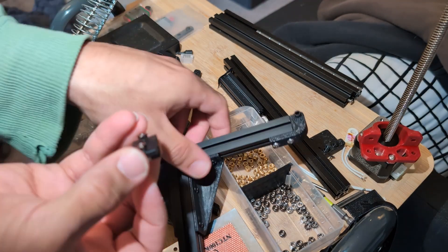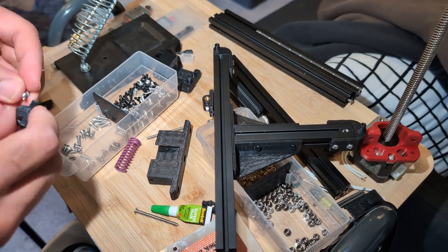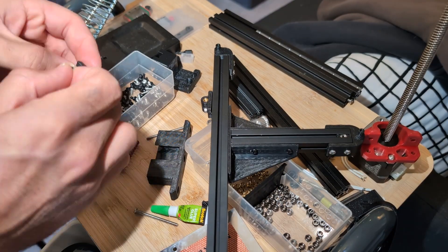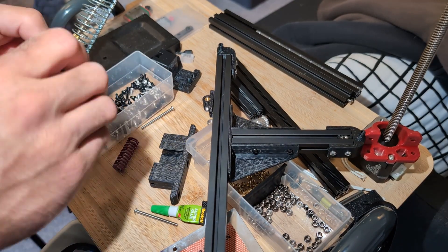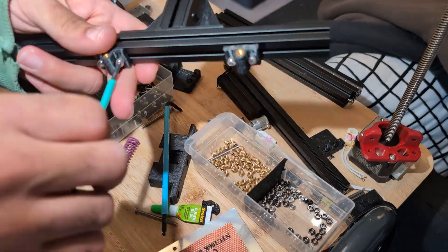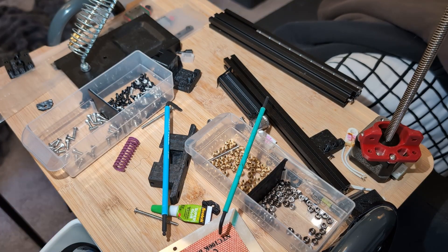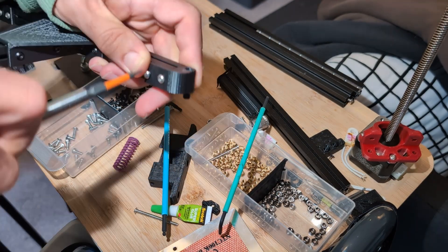It's more compact than the two power supplies I had before. It gives me 275 watts of 24 volt power and 25 watts of 5 volt power, which is perfect — I don't need a buck converter for the Raspberry Pi. It simplifies everything quite a bit, and I've just finished wiring it up and I'm really happy with how the power supply fits.